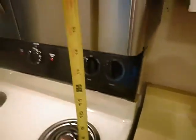Well, that's less than 24 inches. Okay, rule number 2 is the manufacturer's installation specifications. If it's listed, Samsung's listed, see, it's right there, it's UL listed. The installation instructions supersede the code. Now, I don't have the installation instructions, I don't know. I suspect, though, a lot of them say that this corner shouldn't be any farther from here than 35 inches.